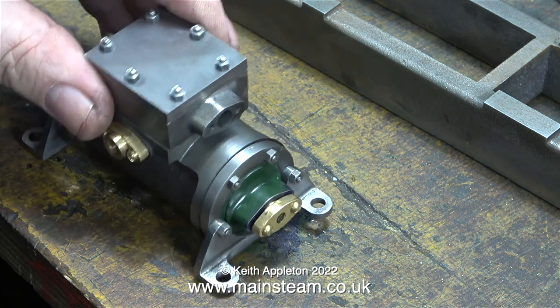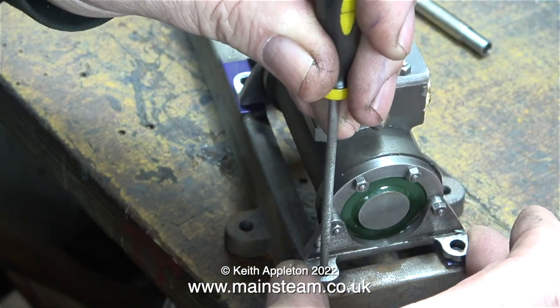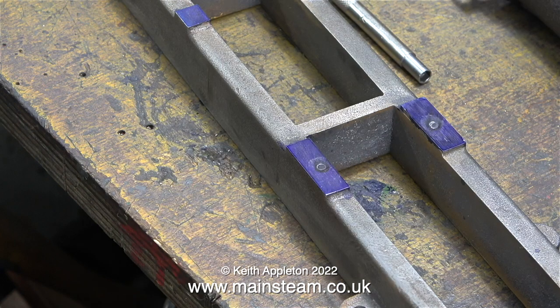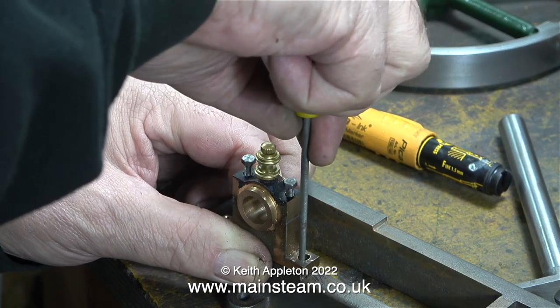This clip doesn't look right — the cylinder is not level — but that's because it can only be level when placed on the bed plate, since the round bottom makes it roll about on the bench. Here you can clearly see what I'm doing: I've applied some marking-out blue to all of the mounting points, and then by holding the cylinder in the correct position, I use a needle file — which is quite sharp and pointy — to scratch the positions of the holes on the bed plate.